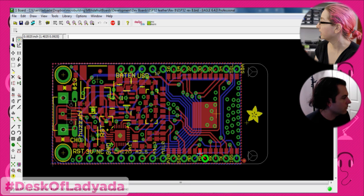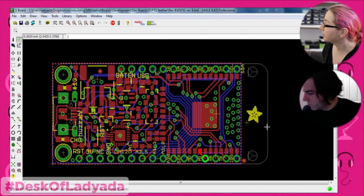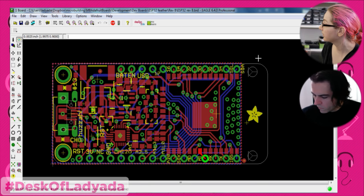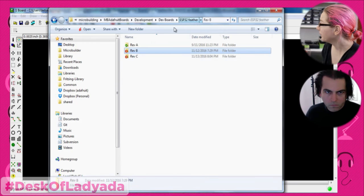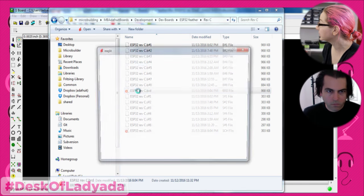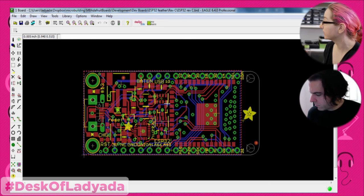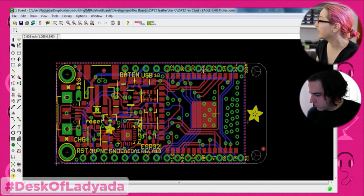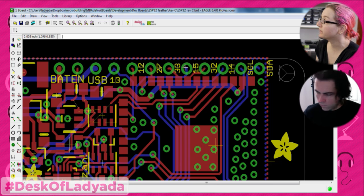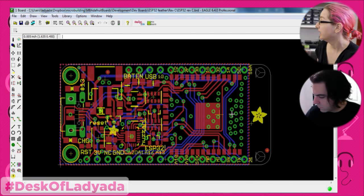And then the SPI, I sort of picked the default DevKit SPI pins. And this is a little bit longer than 2 inches, which is another thing. I couldn't quite squeeze it in. I'm still tweaking it, but this is the current design of the ESP. I'm sort of still routing this area over here. But what's nice is that I've taken out all those pins over here that couldn't do pull-ups. They're now replaced with 14 and 15. So these can do pull-ups. That'll make it work with the OLED.